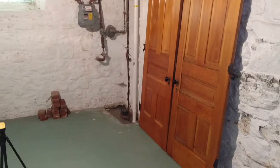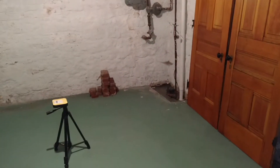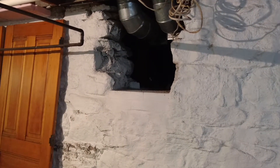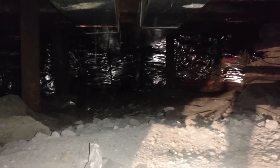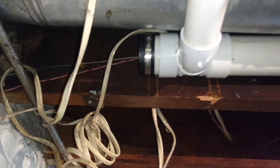So with this radon system running, we're going to let it go for about a week or so, come back and check our radon levels in the basement and then in the room above the crawl space. And if that room above the crawl space comes back high, our next approach would be to encapsulate this crawl space, which has just got a dirt floor, and then add suction to it. And we can do that by just removing the cap on our radon pipe.